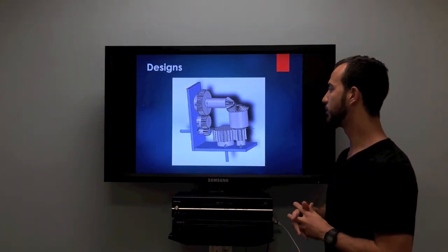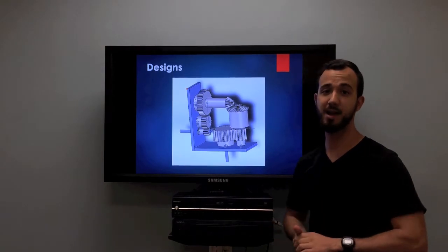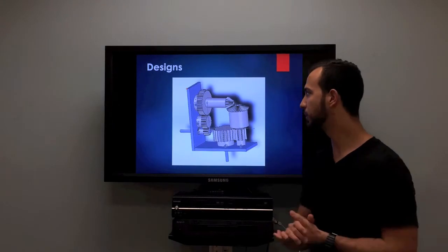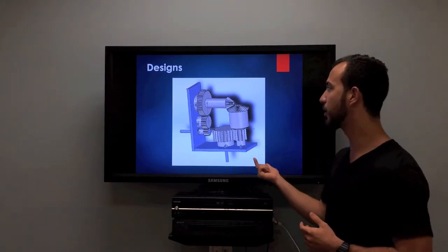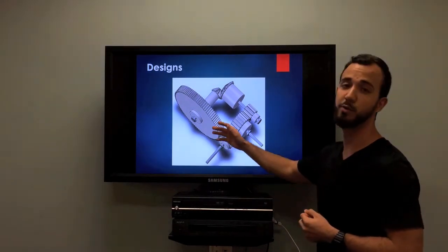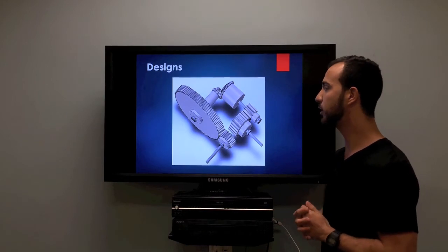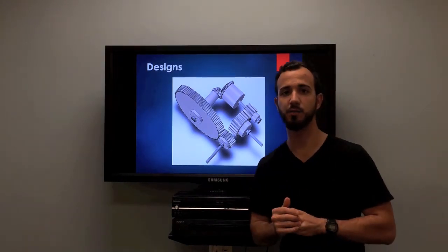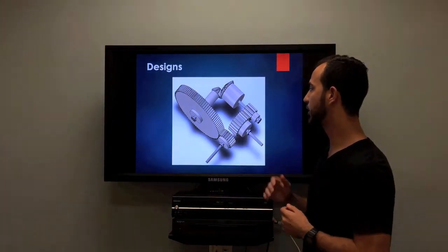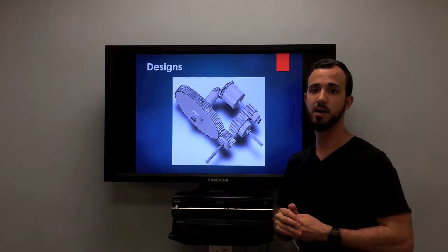But actually, when comparing our Boston Gear catalog ratings to the AGMA process, our AGMA did not pass, which was a little bit confusing for us, that Boston Gear said it would pass and AGMA wouldn't. So this led to our third design, which would be real beefed up gears, keeping our 16:1 ratio always satisfied. Here we really overshot the Boston Gear catalog specifications for horsepower and torque, and shot up our safety factors for bending for each gear, but our wear ended up just passing.